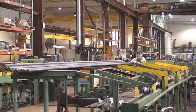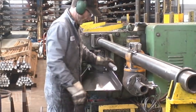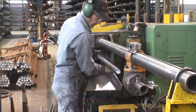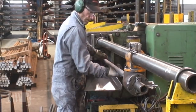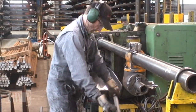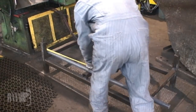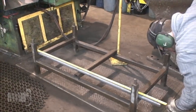The first step in the manufacturing of any bolt is to cut the round bar to length. Our Peddinghaus shears function much like a guillotine and chop the steel rather than using a saw blade to cut through it. We are capable of shearing round bar up to 2 inches in diameter and up to 100 inches in length. Bolts that are larger in diameter or longer in length are cut using a band saw.